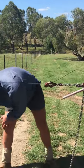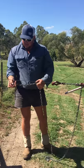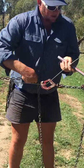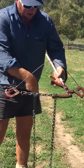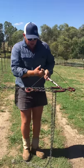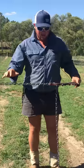If you do have a second set of strainers, a quick way of getting out of loosening your wire again — because you've just got it nearly tight — is to add a second chain, which you need a second set of strainers for. So you put your second chain on and reverse this here — reverse our last move which disconnects that, which lets the chain go sloppy a little bit. Then pick a spot on the chain and clip our second chain into the tooth that you've just undone. Now if we walk it forward again and tighten it up, it will let that first chain loose and we can take it off and continue walking up that chain with your second chain.